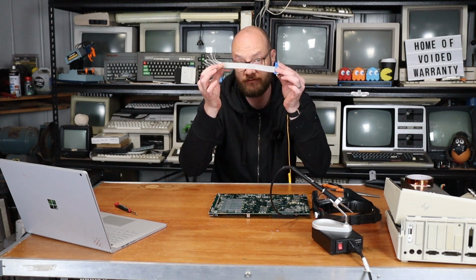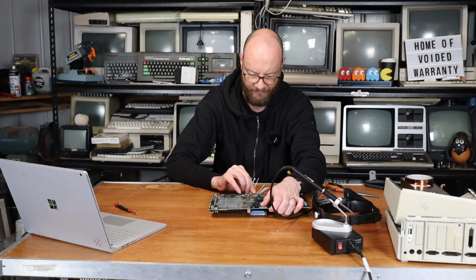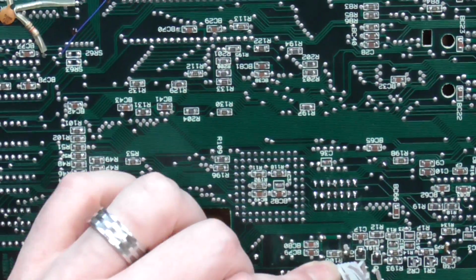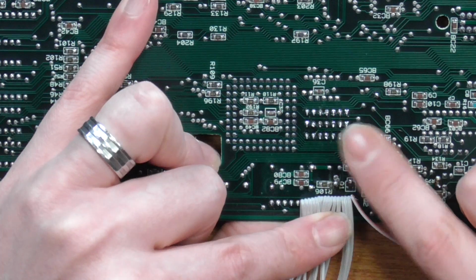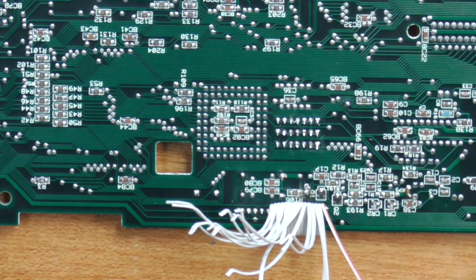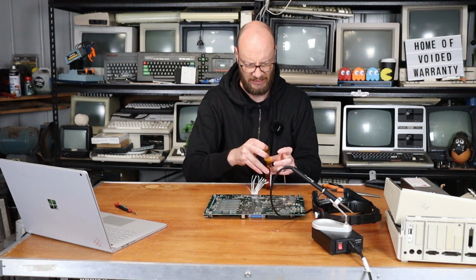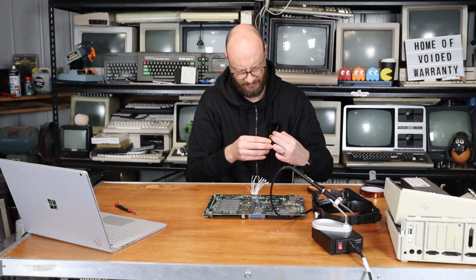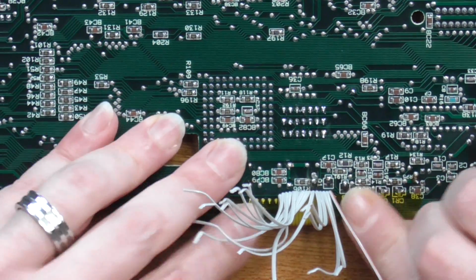So taking our ribbon cable and connector, I'm going to feed this up underneath the board to make it a little easier for me. And that fold that we still have should line up somewhere around the edge of the actual PCB and kind of line it up with the 3 rows of the resistor pack. Having done this, well, at least once before, I'm also, just for my own sanity, going to put a bit of Kapton tape, which of course is just folded in half, just along the back here to at least attempt to hold everything in place.